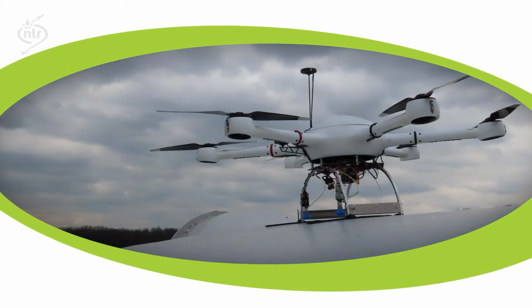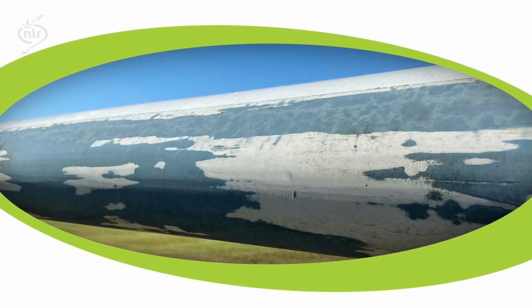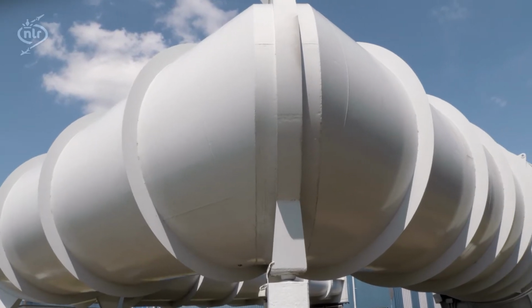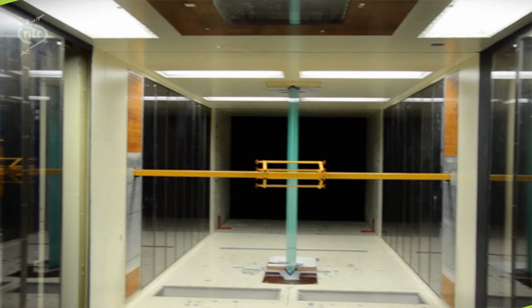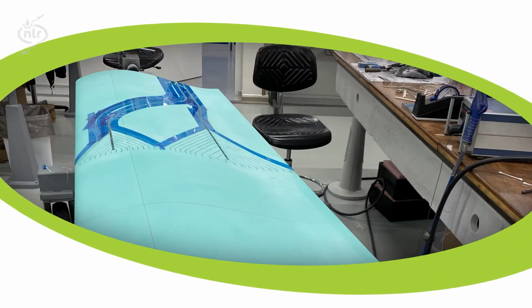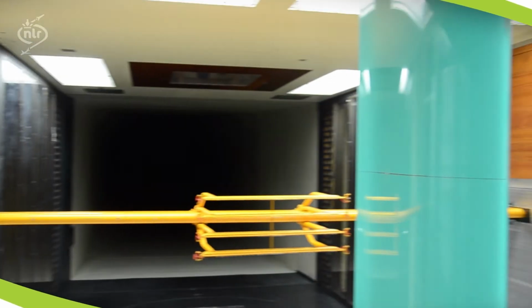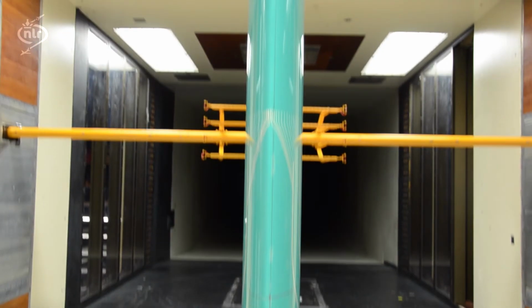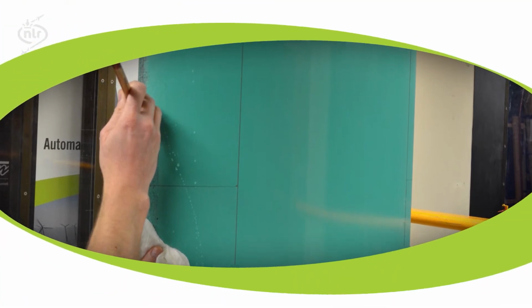To support these calculations, the effect of erosion on the turbine blade efficiency should be put to the test. This is done through wind tunnel experiments in the DNW low-speed wind tunnel. Royal NLR manufactured the two-dimensional model to simulate a turbine blade tip segment. For the first time, a lightweight, low-cost polyurethane material is used for better operative flexibility.